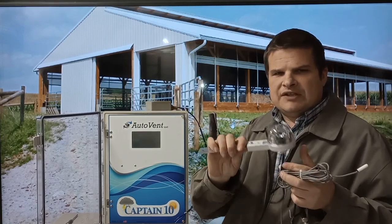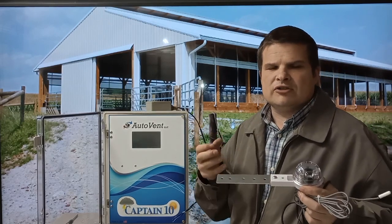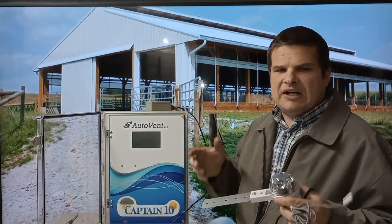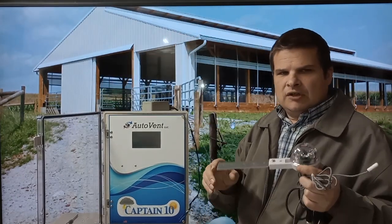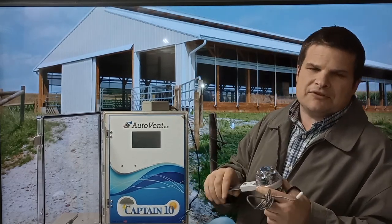With the rain sensor, you can add up to three, but in reality we rarely use more than two. You can have separate zones for either side. This unit handles up to five curtain circuits total — top and bottom on each side would be four curtains — and then you have the rain sensors connected to the bottom one on either side.